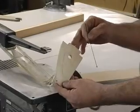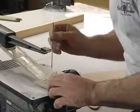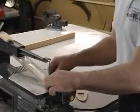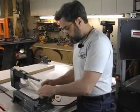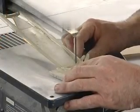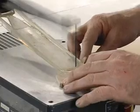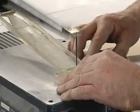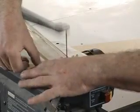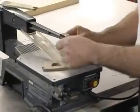This is the nose rib that we just did on the thin curve band saw. I'm going to — I've drilled a hole so that we have a way of getting the blade on the inside. We'll loosen, remove, and reinstall the blade and tighten up the tension. It doesn't have to be overly tight. Now you need to hold firmly to your piece of wood, because if the blade gets it and you're not holding on, it'll jitter around. We're going to cut out this interior space.